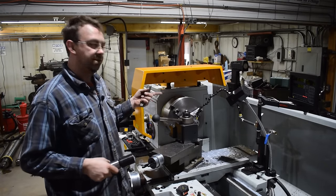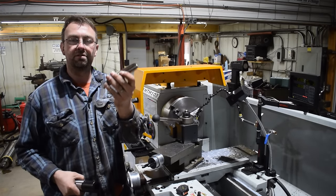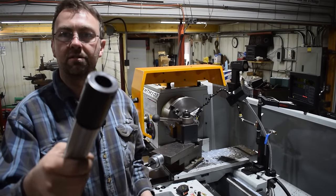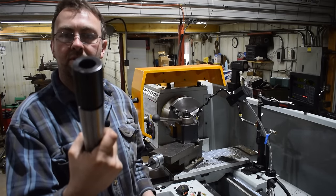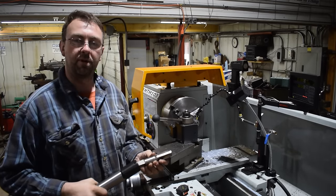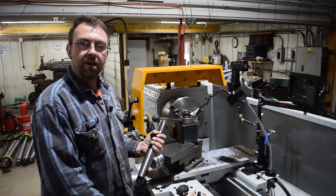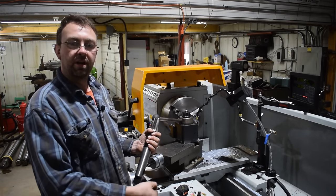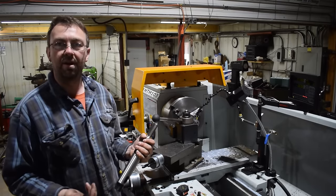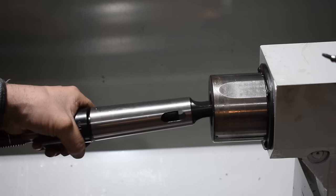All right, so we got our 1 7/64 hole drilled for our tap. This is an 1¼-7 national coarse tap, and we're gonna use a Morse taper tap holder in the tailstock, and we'll just feed it in. That's the nice part about the clutched headstock: I can feed it in, stop it, and then feather it into reverse and bring it in nice and slow instead of it snapping right up to the 50 or 70 RPM that I'm actually gonna thread at. So, let's get that going.